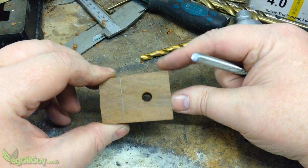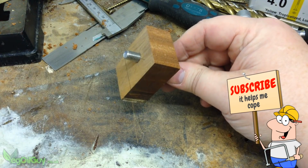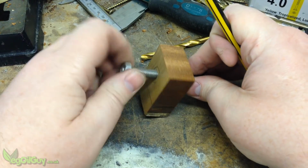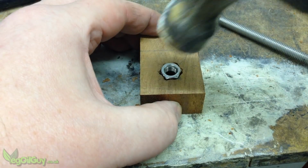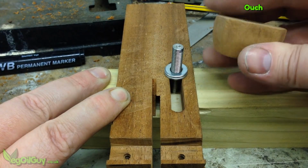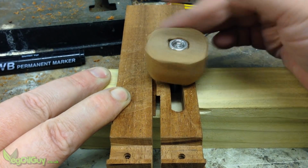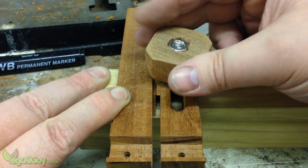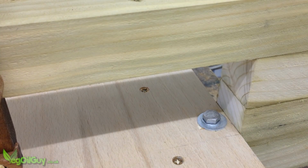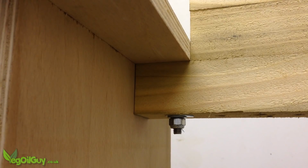I took a small offcut to make a control knob. A bolt-sized hole was already drilled through its centre, and this let me mark off the size of the nut. This shape was partly drilled and partly chiselled out. I shaped the knob with sandpaper, then test fitted this with a couple of washers. I then used a sturdy bolt to fix the arm in place, and that pretty much completed the build.